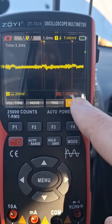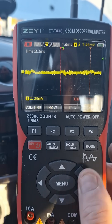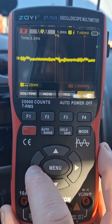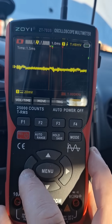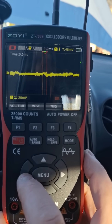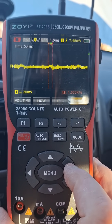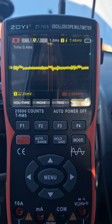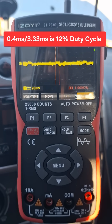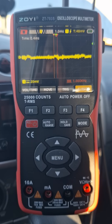What we can also do is measure the duty cycle by looking at the length of this little hump right here. Taking our cursor over to there, that is 0.4 milliseconds approximately, which is about a 13 percent duty cycle — which is exactly what you'd expect on this solenoid when it's energized but not actually doing anything.